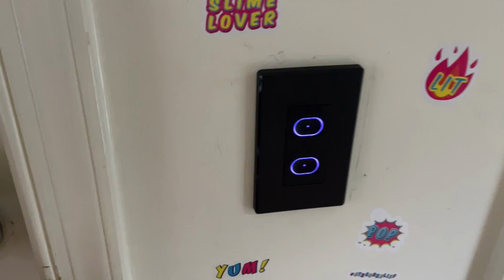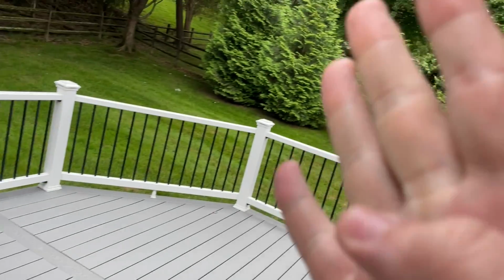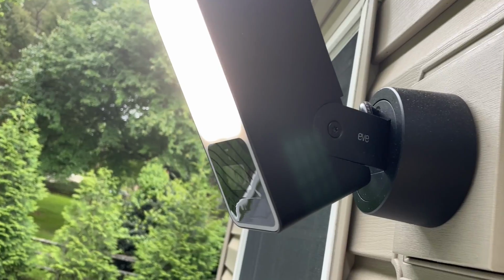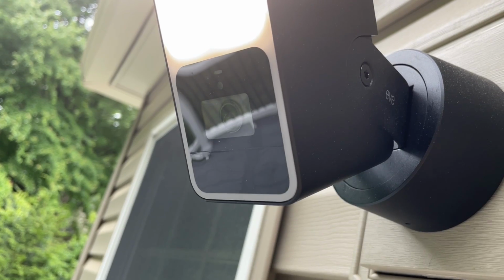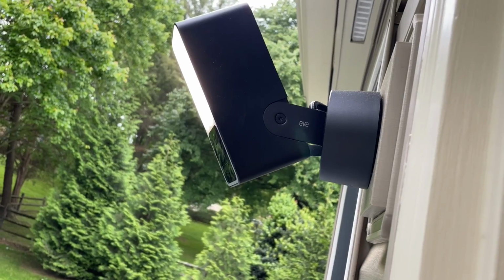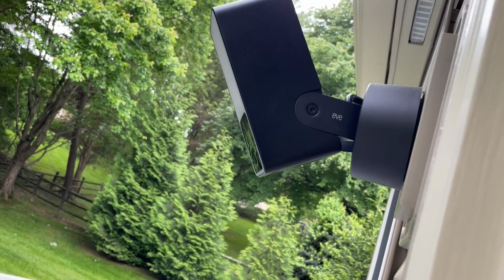And the way that I did this is with a LIFX switch, which is the only switch that I know of that can do this within HomeKit. Hopefully other manufacturers will listen and follow, because this is a great feature to have the load wire constantly on so no one can accidentally shut it off, but you can still control the light through automations. Now, of course, there is a delay because it's automation. I wish it was a little bit faster, but it did take about 4 to 5 seconds for the light to come on once someone hit that switch on the inside.